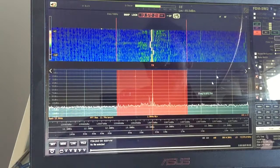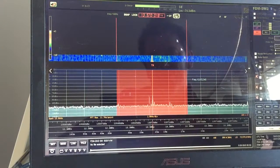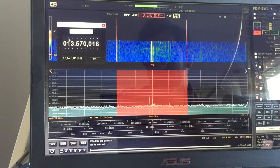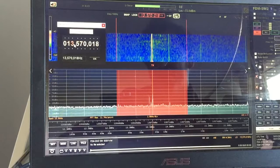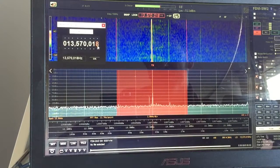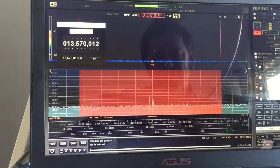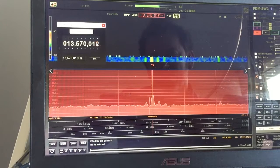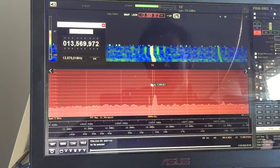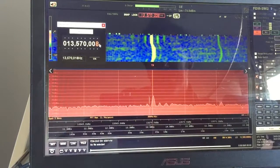When I'm actually tuning through the bands, I quite often use the mouse wheel to get the signal pretty close. Zoom in and out. The most accurate way of tuning is to double-click the frequency box — you get an advanced tuning frequency dialogue that comes up. You can tune to within a single hertz: hold your mouse cursor over a digit, it changes color to red, then turn the mouse wheel up and down and change with a resolution of single hertz. Zooming in on this signal, you can see the signal displacing by single hertz, so you can tune very accurately using this method.